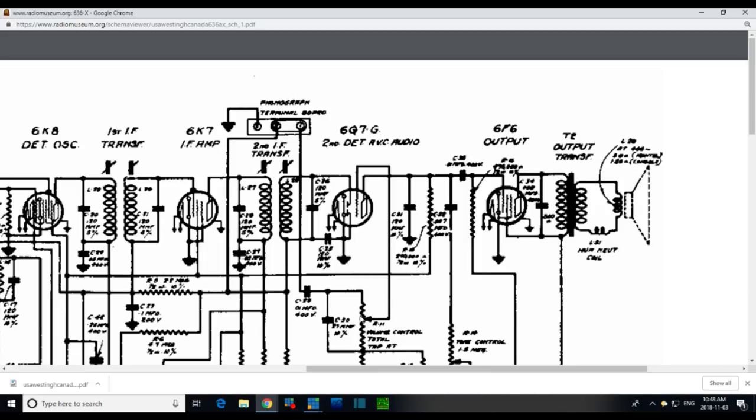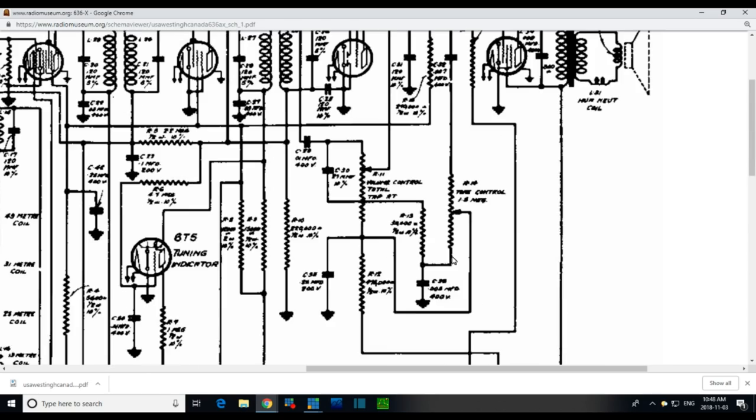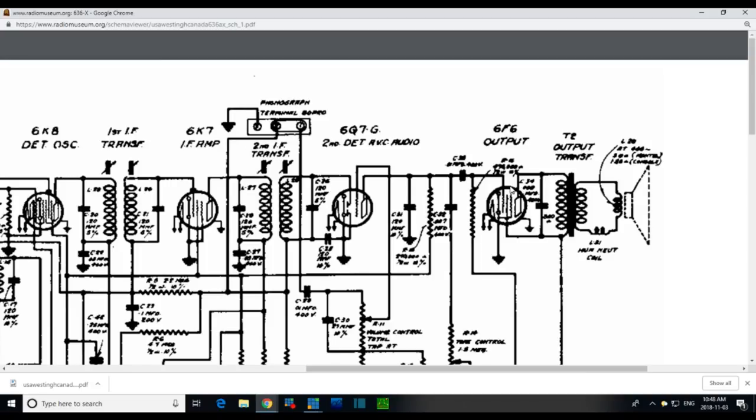This manual I'm looking at, is this the manual? No parts list here. Okay, I don't know what else it can be. I mean, we're seeing it clearly here, connected clearly. This must be it. So what I'll do is try to take a resistance measure. The set hasn't been on yet, so I can get away with it. I'll try to read the resistance from here to the chassis. That'll give me the resistor resistance. Okay, good idea. Sure it is. Let's get the bigger view in here.